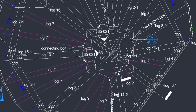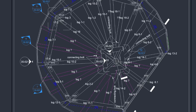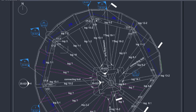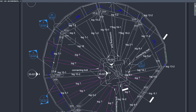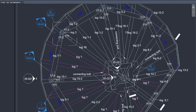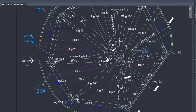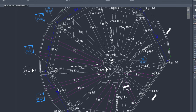Hey look, hopefully all good. Finally got the plan changed for the gazebo with the new beam construction. Before there was only one beam in the center between those columns, so the, let's say, circumference or ring beam around. So now I've got two, like we already talked about earlier. The reason for this is because the mother beam is not that heavy anymore. It has to take the load, especially from these two. But then I thought it would be good because the wood on top, the planks of the roof itself, don't have to be that thick if you get the beams more frequently.